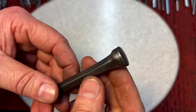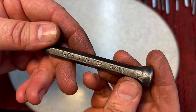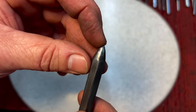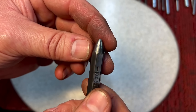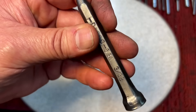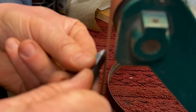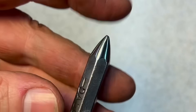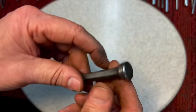Sometimes you might come across a beautiful little chisel like this — it's got a nice wide flare on top. You can see it's a Dasko. The tip geometry is strong, but it's a little blunt for what I might want to use it for. So I want to sharpen it up a little. I'm going to take it to the belt sander and reprofile it. I'll show you how you can reprofile a tool to make it really helpful for your kind of work. We did a nice little touch-up on that tip — not super sharp, but just sharp enough. Either metal or wood, it's a nice size to bang.